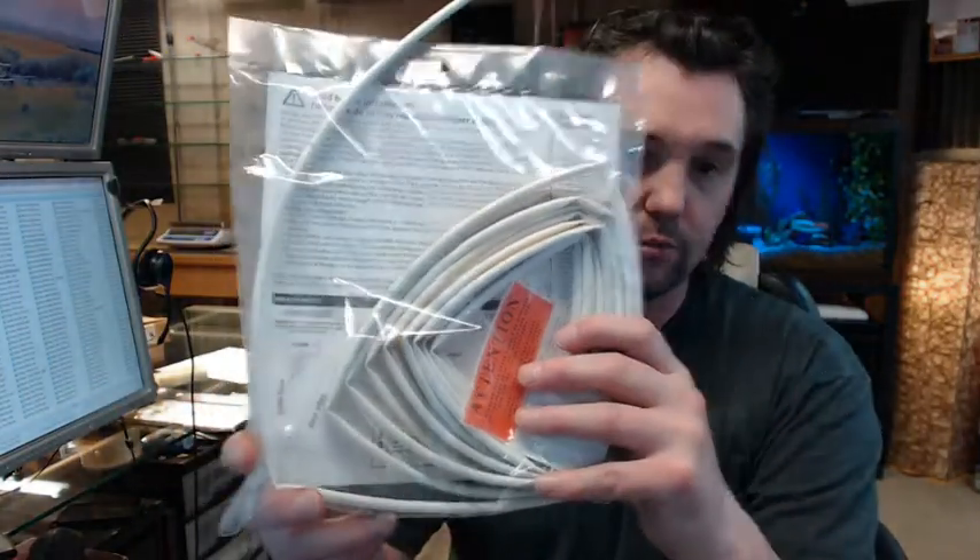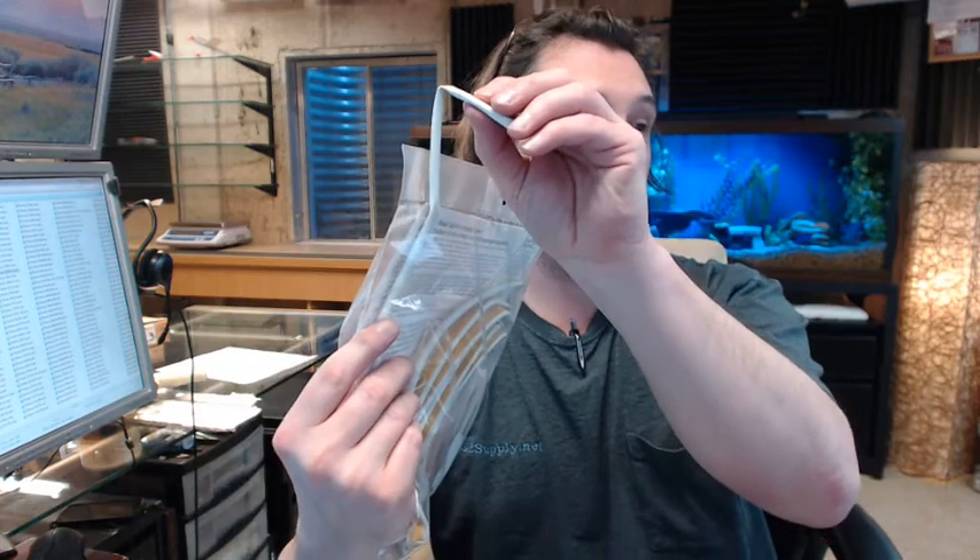Instructions are included with this material. There is a link below this video to what is called the cut sheet, which shows you how to go about installing the material. The cliff notes of installation are basically this: you have got to have a clean frame — that is why they give you the alcohol pad. It has got to be completely free of debris and clean, otherwise the adhesive is not going to do as good a job staying attached to the frame. If you have recently painted it, make sure it is completely cured — at least a week — don't apply it before then. You are going to want to miter it at the head where the head and jamb meet; that would be a point of failure if you try to install it in a continuous run.